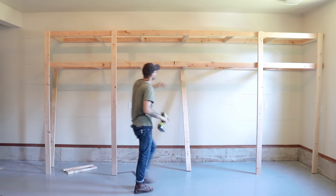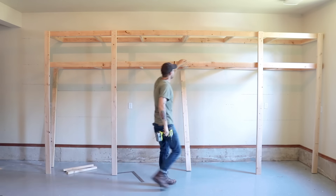The next shelf sections are all 48 inches long rather than 8 feet, so I cut down some 2x4s in half and built shelves the same way as before. I cut my braces down so that I could rest the back end of the shelves while I screwed in the front. It's not so much about holding the weight as it is keeping things from shifting on you while you're working in a different corner.